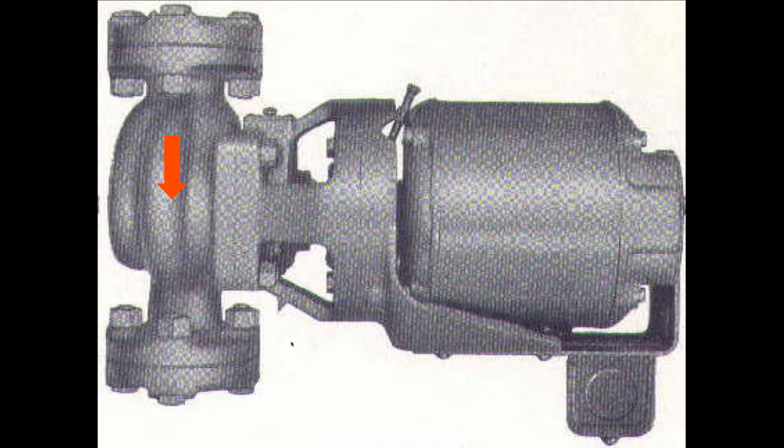Now, another thing's taking place at the same time. On a larger scale, we have engineers that are doing big apartment buildings now after World War II. There's a huge building boom in the 1950s, and they stopped using steam in favor of hot water. So you start to see this big move in hot water, and you also see the great use of what we call these diverter tees, or what Bell and Gossett called the monoflow tee, or Taco called the Venturi tee, because that allows for a less expensive installation, which is comparable to one pipe steam.